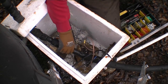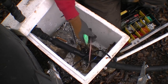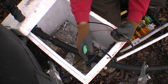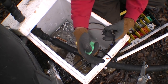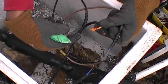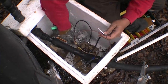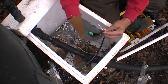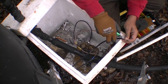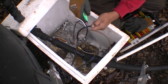I need to come back and put some electrical tape around all this to make it a little bit better. This is the positive wire coming off of the solar panel, this is the negative. I am going to go basically positive to positive to positive, negative through the switch to that. So as long as the float is up it'll get power; when the float goes down to the bottom it'll shut the pump off. Remember, the white is positive on the pump. And the switch — it doesn't matter which side you put the connection on, it can switch the positive or the negative, it does not make a difference.